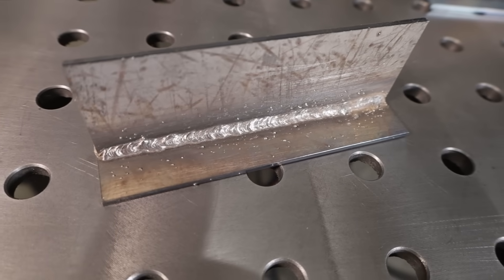You can use basically any MIG welder for flux core. So if you know you'll want to MIG weld one day, you can get a MIG welder, set it up for flux core now, and grow into it. It can weld anything from thinner sheet metal all the way up — this one's rated for 3/16ths of an inch, but there are industrial processes that weld extremely thick material using heavier duty equipment with flux core. You still have that slag to deal with. Watch as I weld along here — I'm just maintaining a steady distance with my arc between the end of the gun and the workpiece, moving along and depositing metal the same way. At the end, after I remove my slag, I got a pretty nice result.